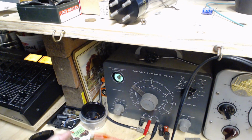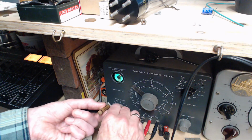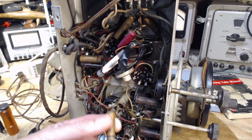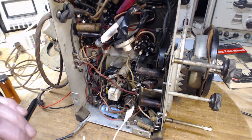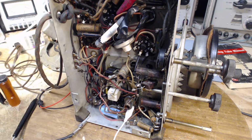Now, this guy's duty, where he was in the radio, there's not much voltage. He's not blocking B plus or anything like that. So this guy was perfectly serviceable, and I've taken him out. That raises a lot of questions about all the rest, and what benefit there is in going ahead and changing all these capacitors.